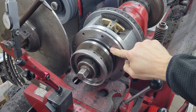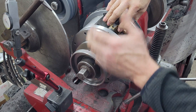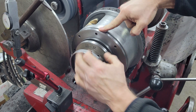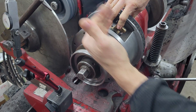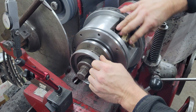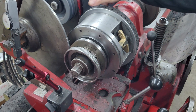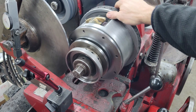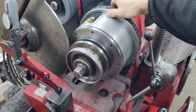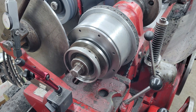Here's the index plate. We grind one lobe and then go to the next lobe — zero is always the centerline of the lobe. As we rotate around and pin it to different locations for the next lobe, it's basically just a follower system. It's on the intake now and the table is rocking as it follows that master plate. It's been done this way and still done this way today — it started probably in the 20s, maybe even a little before with Winfield.